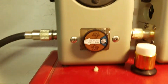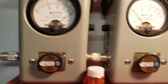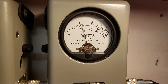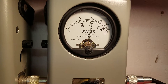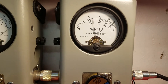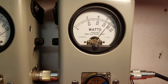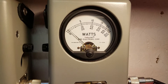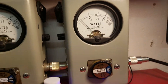Our power is all the way down — 5 watt slug, 5 watt carrier, 10 watt slug. Roll up to 20 watts carrier. I'll show you average power swing: 44 average. Hit a peak, roll it down some. Roll it all the way down to a 5 watt carrier — about 77 watts peak.